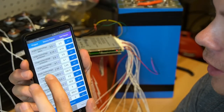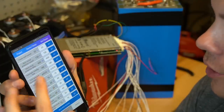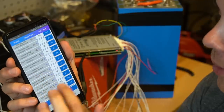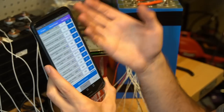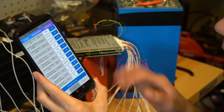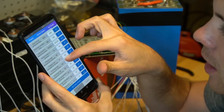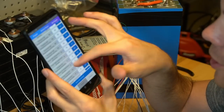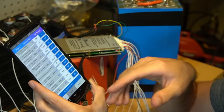Now we have all of the settings. We can change the disconnect voltages, current sensing, short circuit protection — this thing has amazing features. Look at this: charging low temperature protection. Every feature you could ever want. You even have short circuit protection delay, standby time, number of batteries charging, high temperature protection, low temperature protection — everything. It also has a coulomb meter so it can track how many electrons are going in and out.